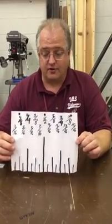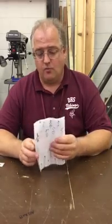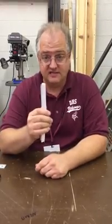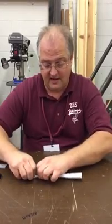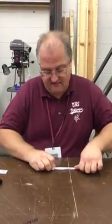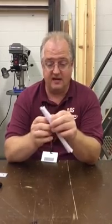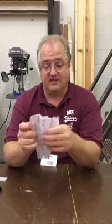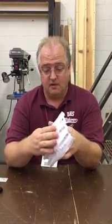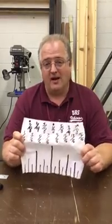For the intro to careers in industrial technology, you need to be able to read that tape measure or ruler down to a sixteenth of an inch. When we go into the building and construction class, we also need to take our sixteenth and fold it in half again. One-half of one-sixteenth gives us one-thirty-second. Here is basically one-thirty-second of this sheet of paper. I could open that up and draw tick marks just like I have with the sixteenth scale — getting closer and closer precision in terms of measurement and where we need to cut boards.